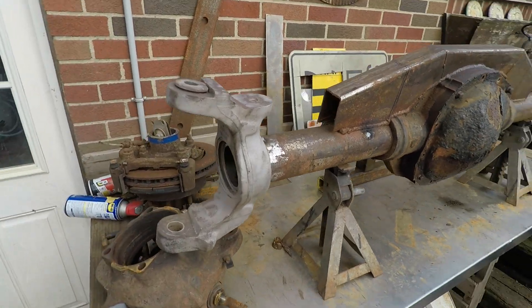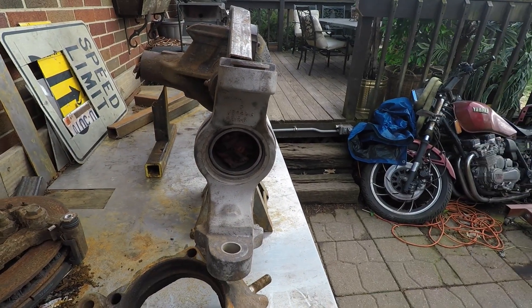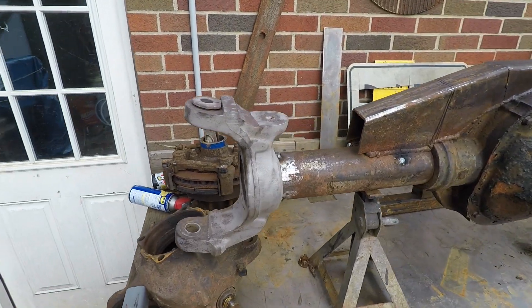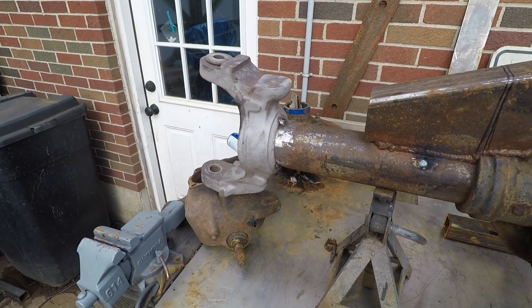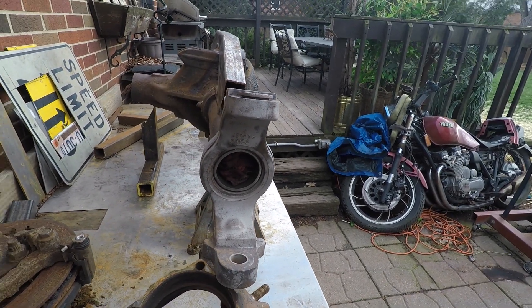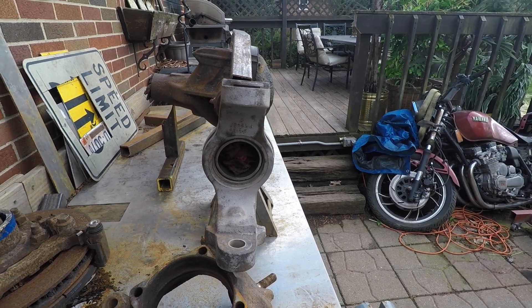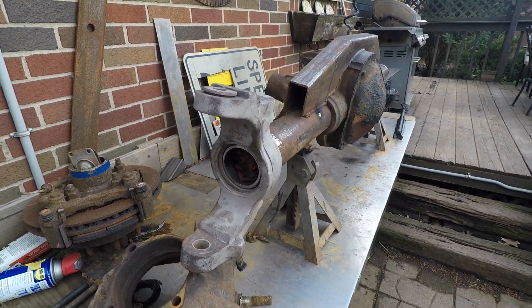This week at work I was able to machine out the knuckle that I cut off — the C I cut off a couple of days ago. Cut it, machined it out, and slipped it on. It's just a hair oversized. In the middle I'm using an old Bridgeport, and even with the table locked down it was just rocking just a touch, so I got a little big on this end and dimpled the tube up. It took a light tapping to get it to press on.